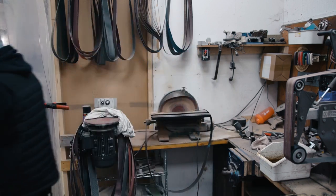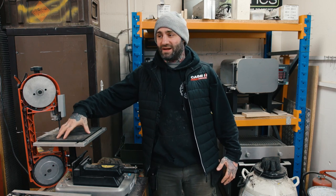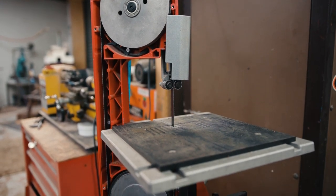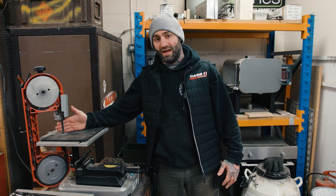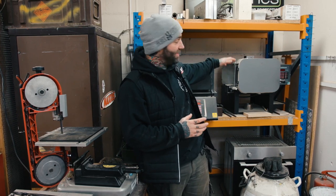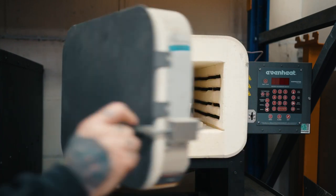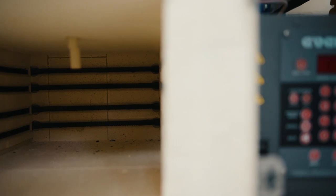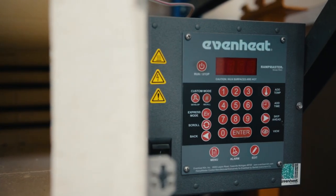Two more important tools in the knifemaker's workshop: a metal cutting bandsaw. Not only do I use this for cutting the knife blanks out, but also for some of the scales — because I use materials like G10 and carbon fibre which are really hard wearing on a wood saw blade. And another piece of kit invaluable to a knife maker is a heat treatment oven. Before I had one, I'd be putting things in the forge and standing there monitoring it the whole time. Now I can just stick it in — it's temperature controlled, I can go off and do something else, the alarm goes off, and I quench it. No standing around watching things.